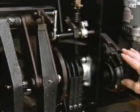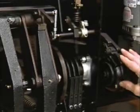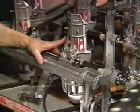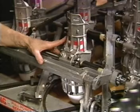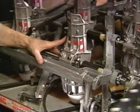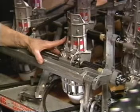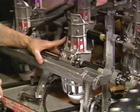This is what controls the table height, either respotting height or spotting heights. Attached to this table drive assembly is an over-travel clevis supporting the table torque tube weldment. Every preventative maintenance program should include a thorough visual inspection of every component that makes up that major assembly. And this, of course, holds true for the table also. All components would be inspected for damage, excessive wear, or any problem that might result in pins falling rather than being spotted as they should be.